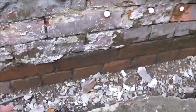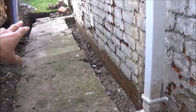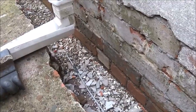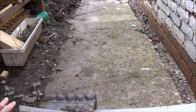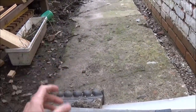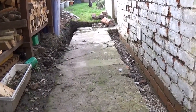The plan with this trench is to dig it down a little bit deeper. I'm going to put a perforated trench-type drain along here, and that is then going to go off in that direction into my foul sewer. I'll then backfill this with gravel, and any residue of water that collects in this channel will make its way down to the foul drain. My path is currently sloping in this direction anyway, so the majority of surface water flows this way. I'm going to connect the channel drain, and that will also flow down into the foul sewer. Both will go into a P-trap prior to going into the foul sewer to avoid any bad smells coming back up the pipes.